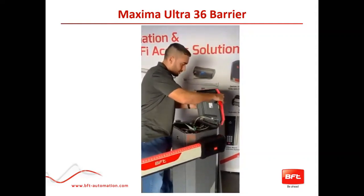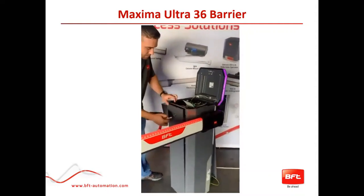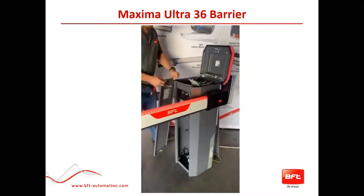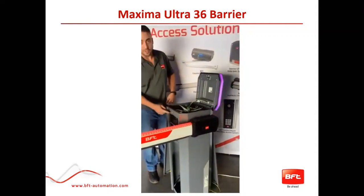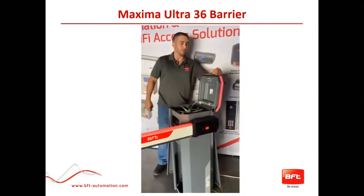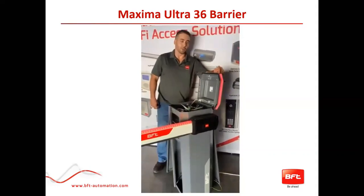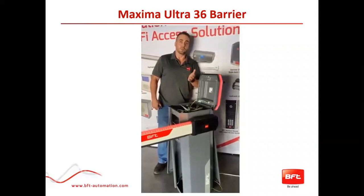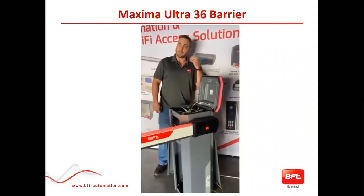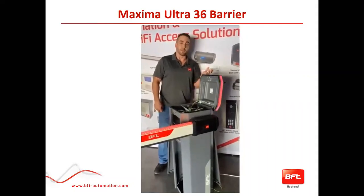You can also remove the front and back door. When I took the front door off, the interlock is open, and right away the accessory light kit is going to start flashing violet or purple — that's an error for the interlock or fuse. So when a customer calls and says their operator is flashing purple, you're already a step ahead to help save time and money.